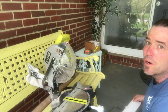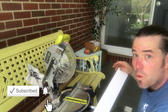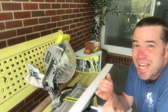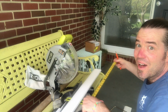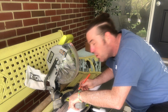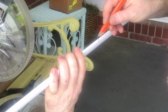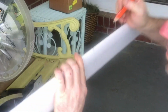Now to cut an inside corner, say my piece is 12 and 5/8 long. I've got a straight edge on one side, but the other side I'm going to need to cope it and lay over the corner piece. That way it gives it a nice tight finish. Now 12 and 5/8 is my full length. I'm going to mark it at the top of my baseboard because that's where I'm going to be doing my cutting. Now I'm going to lay my 45 and cut this way from the back of this line where the back part is. So the 45 is actually going to go like so.